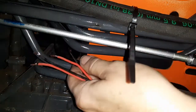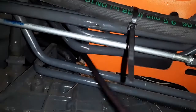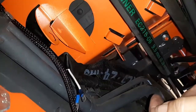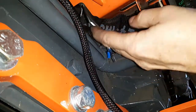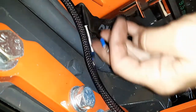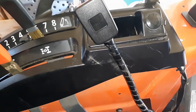So bring it down in there, get your mark on where you're going to send your red wires one direction, your black wires will go to the front to actually tie into that 3rd function valve. It'll make it so much easier than being underneath with a pair of scissors trying to get this thing cut off and potentially damaging your wire. Fortunately I didn't, but that did cross my mind. Didn't keep me from being a dork and just laying under there and wrestling with it.